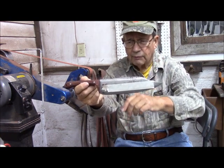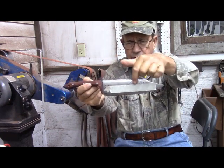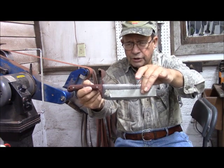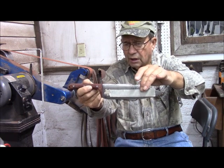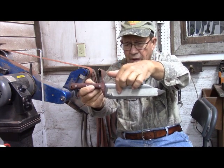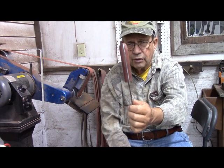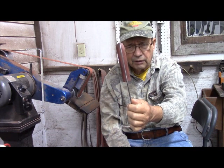So consequently, what I'm going to do is to cut out a portion of this blade where you see the tape. I'm going to remove that much steel, which is going to lighten the blade, and also remove this part, which is slanted back toward the top, and actually does no functional purpose here, outside of adding strength. We're going to leave enough room here so it's not weakened so much by this star, and also then remove the grips themselves, re-harden the entire blade, and re-grip.